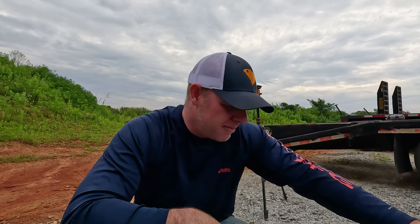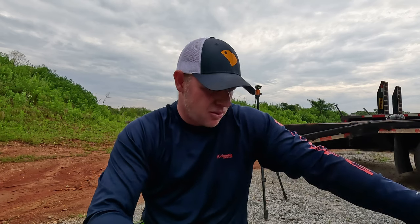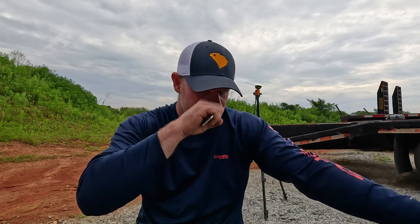My theory is, a lot of this is just my opinion. I've been cutting brush, running these mulchers for coming up on 10 years now. So I feel like I have a good bit of experience running these things, and a lot of sharpening, and a lot of my guys that previously worked for me, a lot of hours. We've seen how they wear, how they don't wear, stuff like that. But a lot has to do with the material you are in. If you are in soft wood, poplar, soft pine, stuff like that, you can run semi-dull knives. It does not have to be razor sharp. If you're sharpening 2-3 times a day in soft material, you are actually just taking that tooth away. There's really no point.